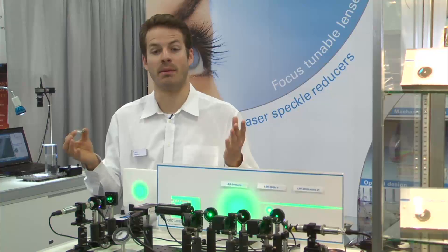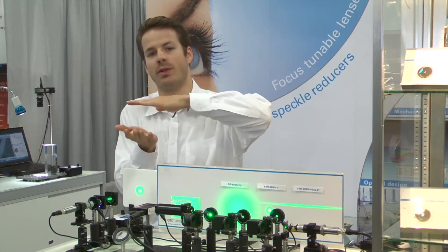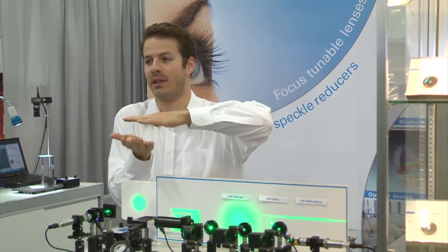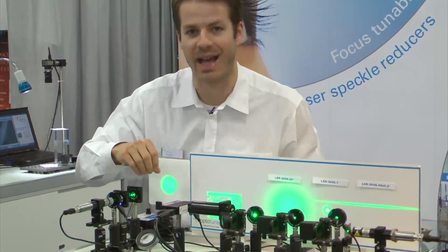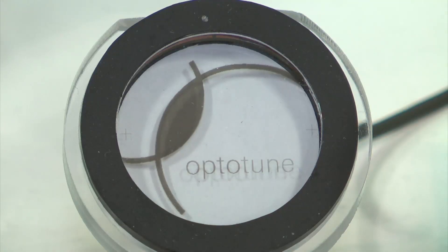One of the key enabling technologies here is electroactive polymers. What that essentially is — it's pretty simple — you take a membrane, an elastic membrane, and on either side you put two electrodes. When you apply voltage, they squeeze together because they attract, and that elastic film squashes and expands. That movement essentially moves this diffuser around. We can actually see this principle here in a demo where we have our logo printed as an electrode, and you can see the pulsating of that electroactive polymer.